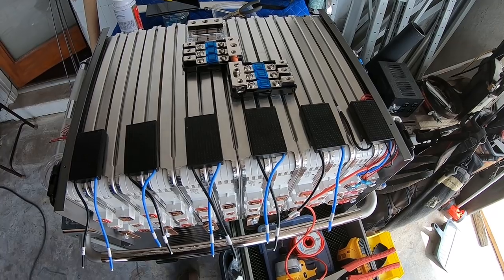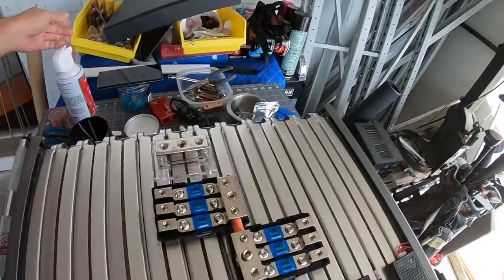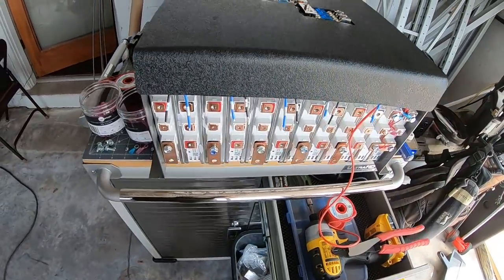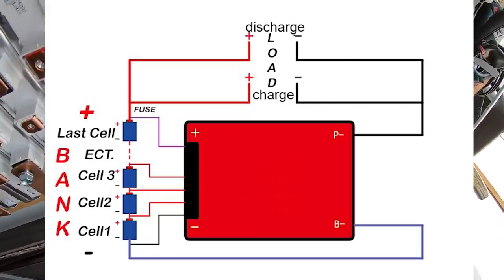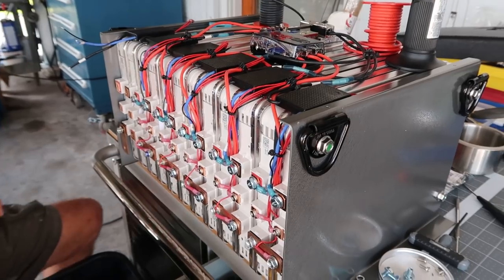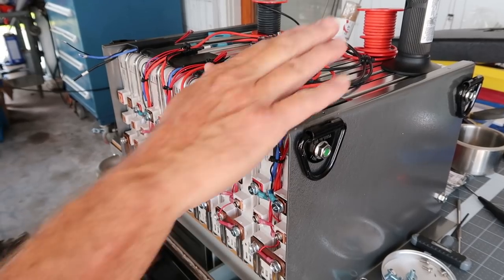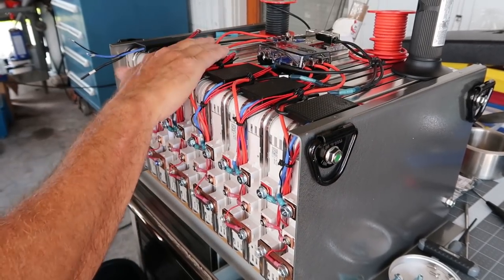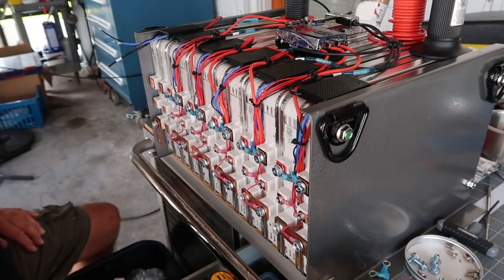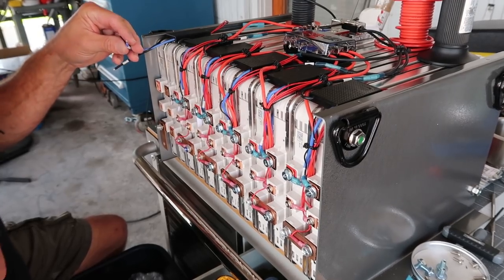This particular pack I was building in the 12-volt series for a brand-new 2019 Leopard 42. We built a cover, top-charged all the cells, and added our battery management system. Each one of these BMSs controls two cells at a time, taking us up to about 15.8 volts. They control both the charging and discharging, and will shut down if any over- or under-voltage occurs.